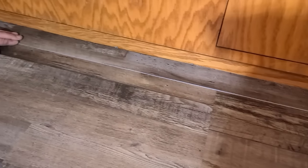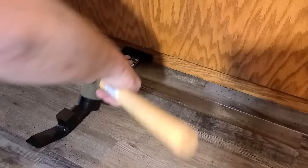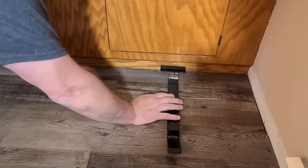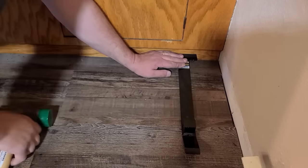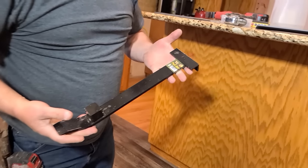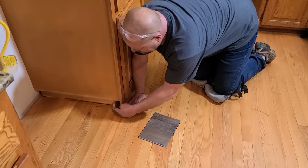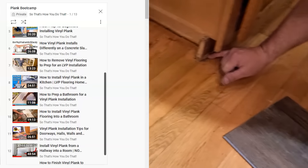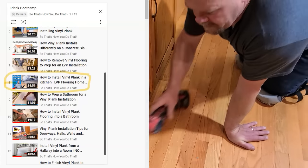This one is going to be a little funky — we're going to use a pull bar to get this to lock in because it's too hard to get in there otherwise. Using a pull bar is the way to access tight areas. This pull bar is a heavy-duty solid steel one — it won't bend on you. I have a spot where the stove goes, and a lot of times the toe kick sticks out past the cabinet. Rather than notching around it, I like to undercut those with my jam saw.